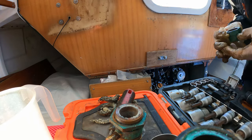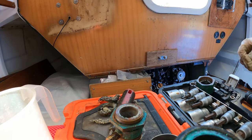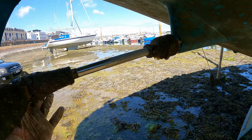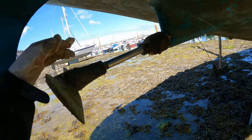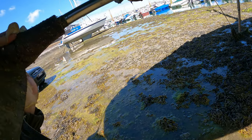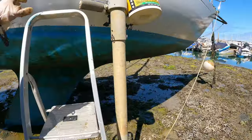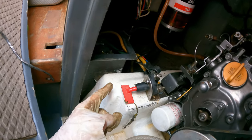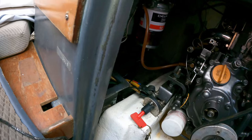Right, I'm going to go test fit. Back down I go. Okay, prop shaft — slide it back in. Oh god, it is tight actually. It's probably crashing into the cutlass bearing there. Back up we go. I haven't even started cleaning the boat yet — might be a job for another day. So all of this water under here is joined to all this water here, and that all comes from this side of the engine bed, which is where that exhaust pipe would leak to. I reckon all of that comes from that exhaust box — yeah, it's dripping away.